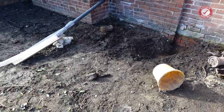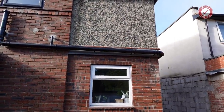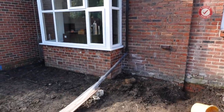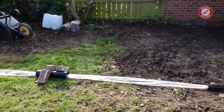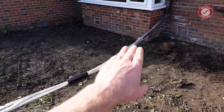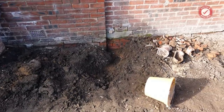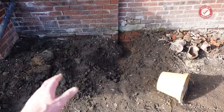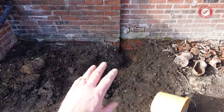In case you're wondering what's happening with the rainwater at the rear of the property - all the bathroom waste now goes through a new pipe run around the corner and now goes to the front of the house, so there's no house waste coming to the rear of the property at the minute. The only thing we have to contend with is rainwater, and at the moment we've got some temporary downpipe material - it comes on a big long tube and you just cut it to whatever length you need, really handy in remedial work like this - so you can temporarily get the rainwater away from the property. I'm going to backfill this because it is now redundant, and that is our final job prior to starting on the groundworks for the extension.